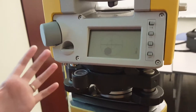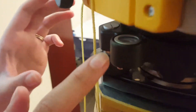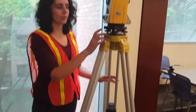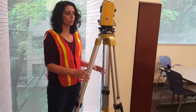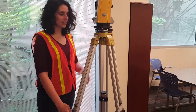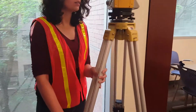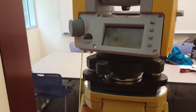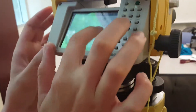There are two leveling options: a little computer level that shows where you're at with the bubble, and an old-fashioned bubble under the system. First, get the bubble as close to center as possible using the legs — this gives you more wiggle room for fine tuning later. If you're not experienced, start with one leg, lock it, then go to the other. By using the legs, we've got the bubble in the center of our level.